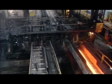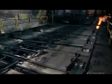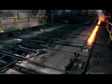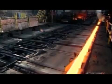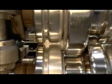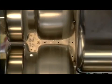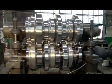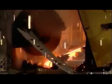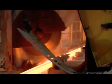For the final shaping, each steel rail passes several times through three consecutive mills. This is what a mill's rollers look like, and here's the standard T-shape to which they form the steel. Next, a saw slices off about 30 centimeters to square off the ends; the cut-off pieces go back to the scrapyard.